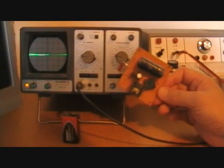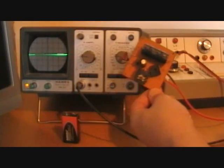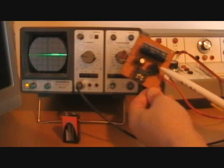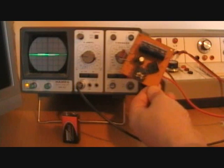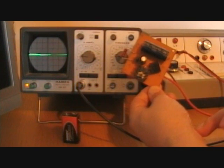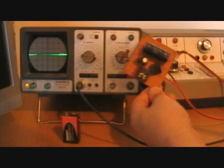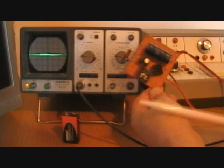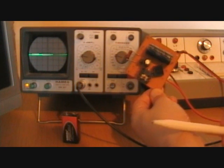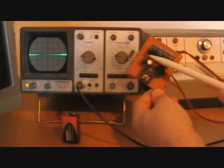Here's the final circuit — a more complete power supply. We've got a bridge rectifier which isn't four separate diodes but is actually encased within some sort of compound, doing exactly the same job as the four diodes we saw previously. There's a much larger reservoir capacitor — this one's 4700 microfarads — and this time we've added an IC regulator, an integrated circuit voltage regulator, which will hopefully take that last bit of ripple out of the circuit.